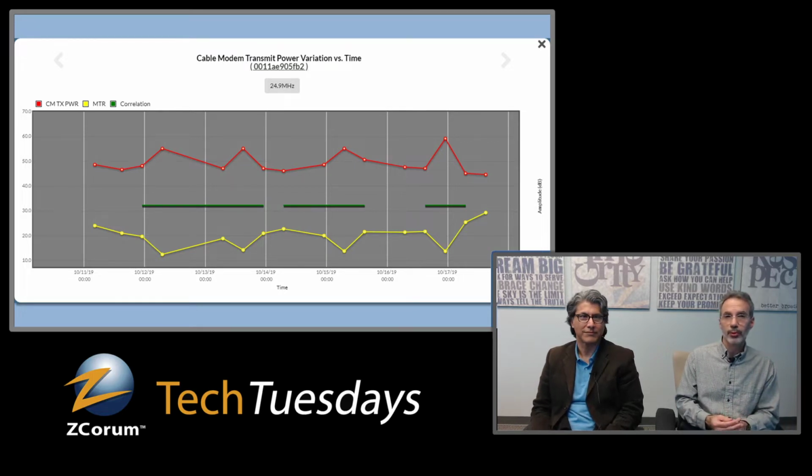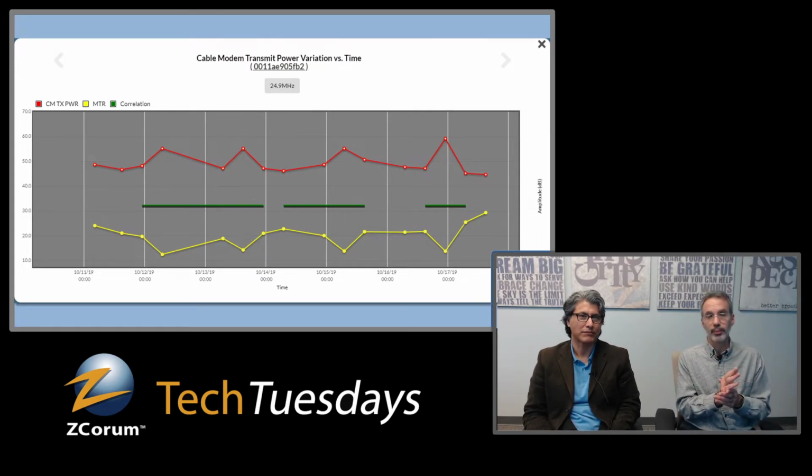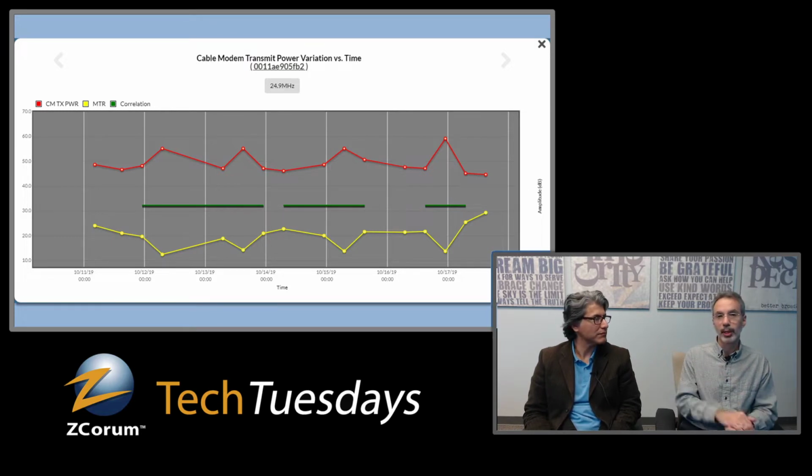It's a ratio. If you know PNM and the digital taps that you have in PNM, you've got your main tap, tap 8, and that's where you want all of your energy going through, but that's never the case. Even in a perfect world, in a lab, there's going to be some up and down, but generally you want most of your energy going through tap 8, and then the other 23 taps will adjust depending on what kind of impairments they're seeing in the cable plant in order to make the signal what the CMTS wants to see.